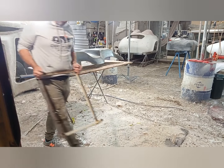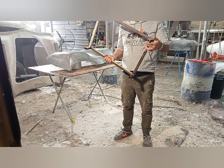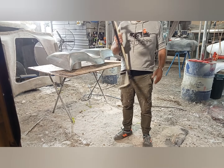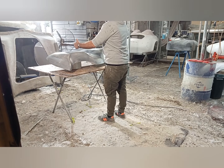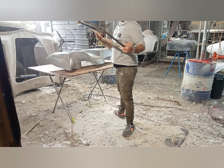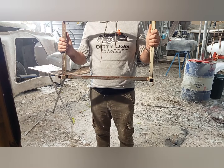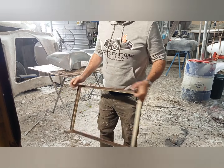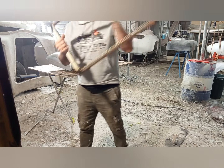As part of the mold for the clamshell, we've gone ahead, and this is just a piece of junk that we had lying around, but it's a little stand, and we're going to fiberglass that stand into here, and then that's going to act as the feet of the mold. So it not only gives strength to the mold, but it also helps you position the mold where you want it and set it nicely on the table.